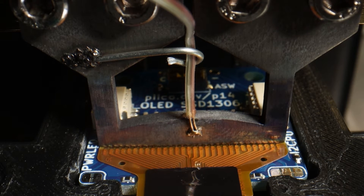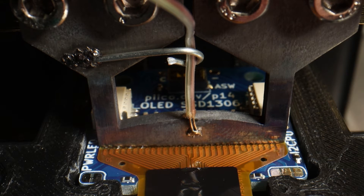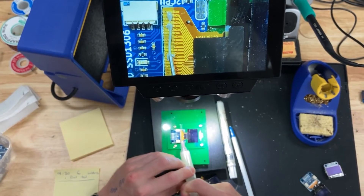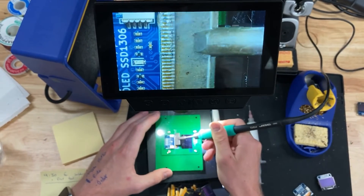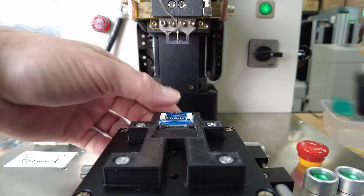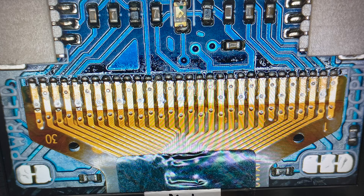The tip applies pressure to the connector, melts the solder, and then while still applying pressure is able to cool down using compressed air to blow that heat away. That's one of the biggest challenges with soldering one of these connectors — you need to be able to hold it down while the solder solidifies so the connector doesn't lift and flap around. Using the hand soldering iron we achieved this with a drag soldering operation, leaving a wake of solidifying solder to help keep the connector pinned down. Now we just place the PCB and the OLED into a jig, make sure the alignment is good using a microscope, and then press the go button.